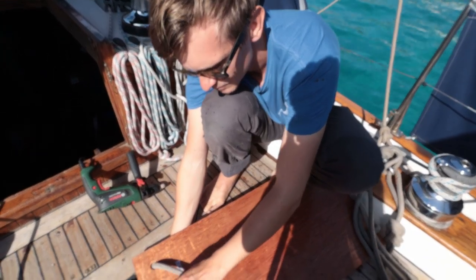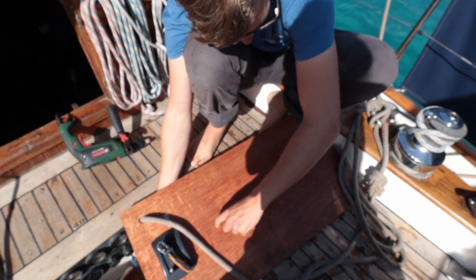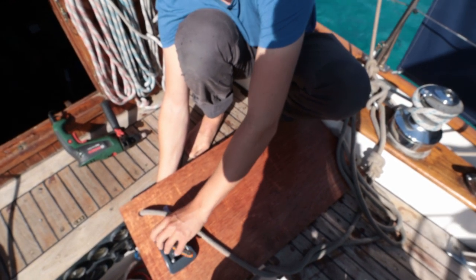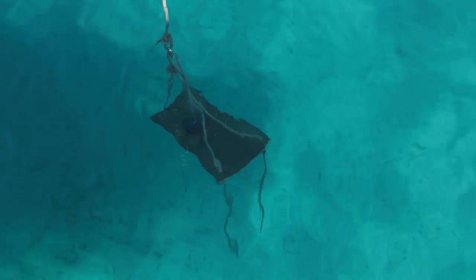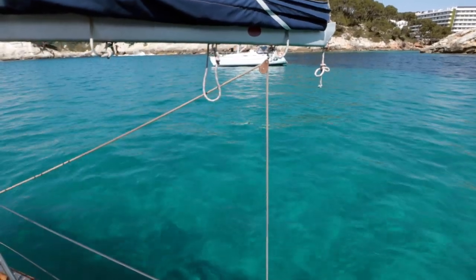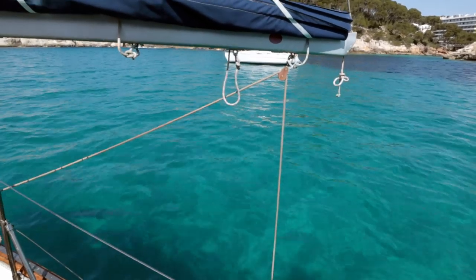We're just moving the weight nearer to the middle because at the moment it just dives and sits there — this end is really buoyant and this end is really heavy. I'm hoping if we have it more towards the middle it will balance out a bit more. That's a little bit better with the bridle just on the surface. It seems to be working because when we're about to roll, the line gets taut — I feel it jerking, trying to pull it level. So the flopper stopper is on.